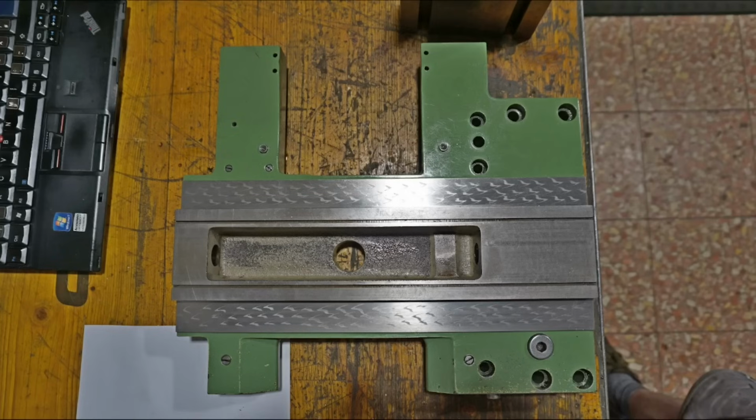And because I didn't want those holes to have large diameter, because I didn't want to take away too much cross section of that cast iron piece, I wanted those holes to be 2 millimeter diameter, so you see there was absolutely no chance for me to drill those holes myself. So eventually I brought this piece to a company that EDM drilled those holes for me, and when I questioned them about the tolerances of the location of the bottom of the hole, they said they cannot guarantee for anything, they will try their best and so on, but eventually I will have to see. And you can imagine how thrilled I was when afterwards I drilled those transfer holes, hoping that I would hit the bottom of these EDM deep holes. Thrilling to say the least.